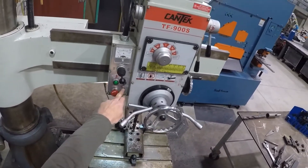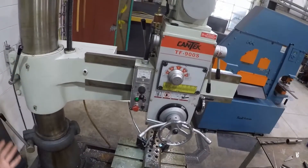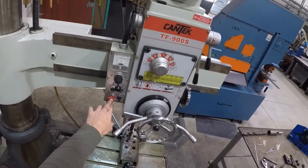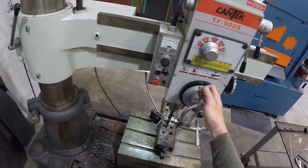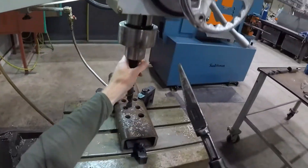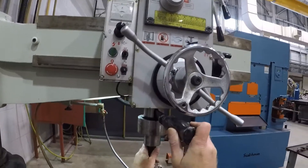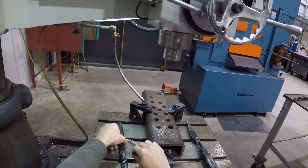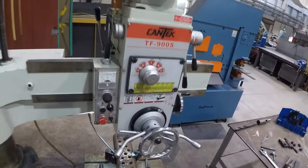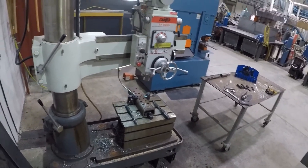You have to turn your coolant off when you're done. The machine is energized but not moving, so when we're done, make sure all the power is taken off. Take your bits off — for this one, lower it down so we can see the slot. Just turn this until the slot lines up, hammer the drift in there, and there we go — got a nice hole. There's our radial drill press drilling a hole. That's it, thank you.